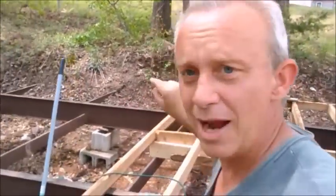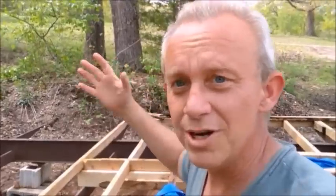And then I'm going to run that right through a breaker box in the house. So once you're inside the house, or heck, even outside the house, it's going to be identical to what a regular house is like. If anything ever happens to me, Carolyn can hire an electrician to take the inverter wire off and run a line to the power pole. That's all it's going to take. I might just run the line myself, and that way if anything ever happens, we can just call an electrician, they can take the wire off from the inverter and attach it to the house.